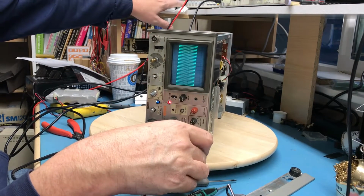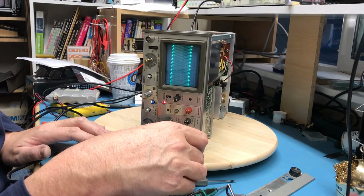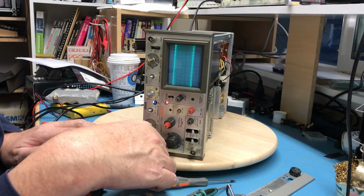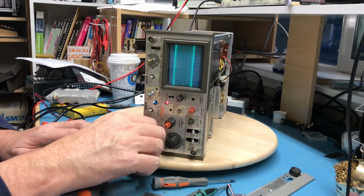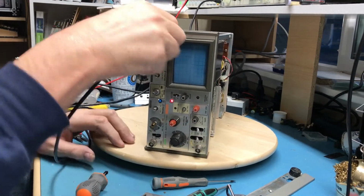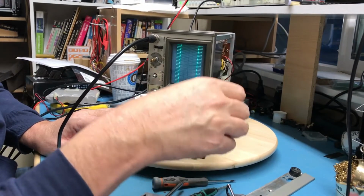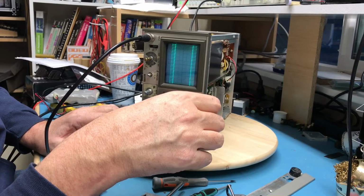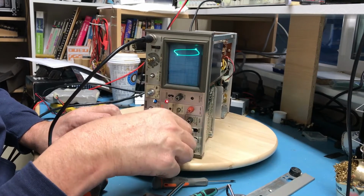Again, that looks okay. Square wave at 5 megahertz. There's some under and overshoot there, but again, I'm unterminated directly out of the function generator into the scope front end. But I'm not unhappy with that. Go back to channel 1. Well, I should put a couple probes on this and hit the calibration and see if we can calibrate it out cleanly.